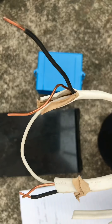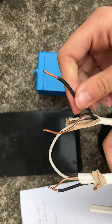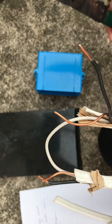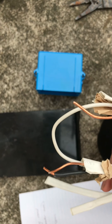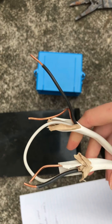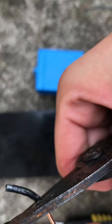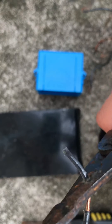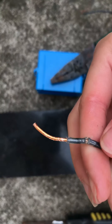Here is the wire after it's been cut. As you can see, there are two black wires, two copper wires, and a white wire — you can cut the white wire if you'd like and put a wire nut on them to mend them together, but I just kept them together. Those are all the wires and they are already stripped. Here I am stripping the wire — I'm putting it inside the 14-gauge hole on my wire strippers, and after multiple attempts and quite a few minutes, I finally got it and it flew across the room.